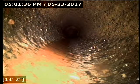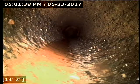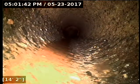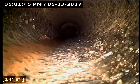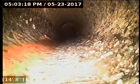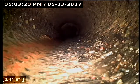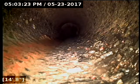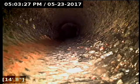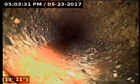In the event that the entire line or concrete section gets replaced, I'm going to mark right here. This is the cast iron transition, and I'll mark this with a white T. Okay, and I marked right here. There's holly bushes, something of that nature, right in the front of the house. I'm picking the locator up pretty much right underneath that stuff, where the transition point is.